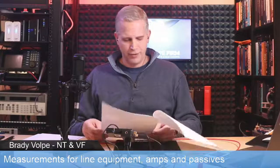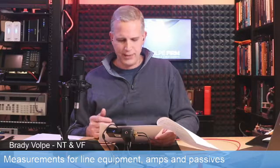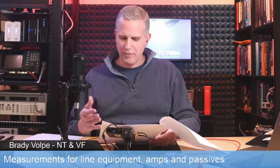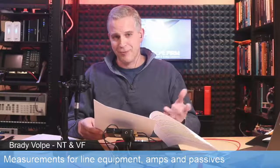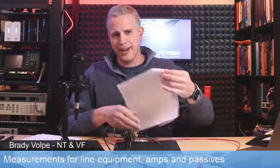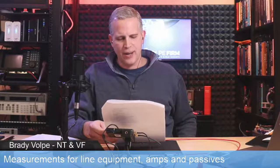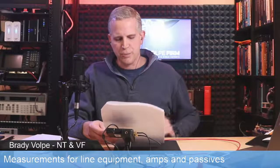The latest update from Jesse said, I wanted to provide an update on my situation. I was able to exchange my Arris SB8200 modem for a new Arris SB8200 hardware version 6. He installed the modem. He swapped out his grounding block. He put in a new Holland grounding block with frequency support up to 3 gigahertz. He put in a 10 dB attenuator in order to get his downstream levels and his upstream levels correct. He's now getting 225 megabits per second down and 11 megabits per second up with a ping time of 38 milliseconds, according to speedtest.net.